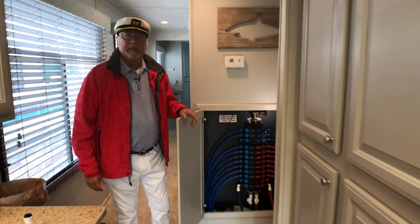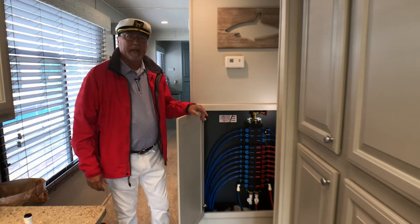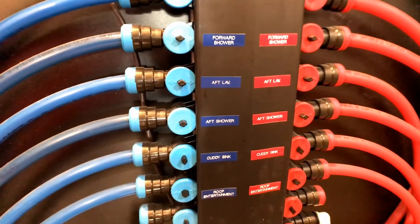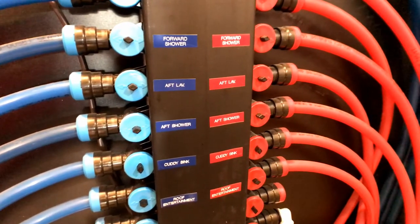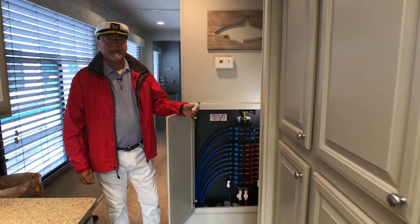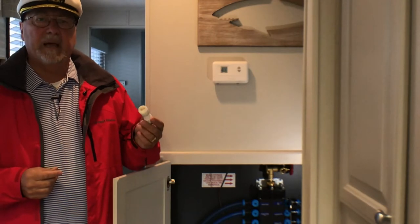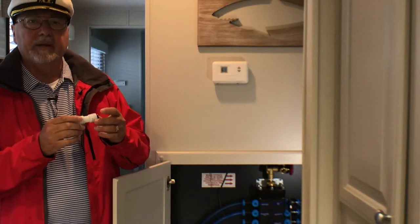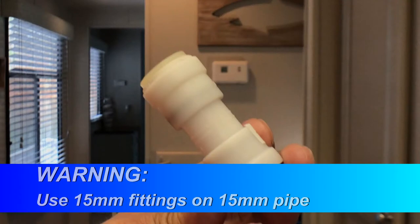While we're at the manifold, it's easy to see the type of water pipes used in the supply plumbing. This type of pipe is called PEX, which is an acronym for cross-linked polyethylene. The boat manufacturer has distinguished between hot and cold water using red for hot and blue for cold. A word of warning to owners who attempt to replace PEX fittings: check that you have the right fitting first. Marine manufacturers may use metric 15 millimeter pipe throughout the boat and not the half inch type found at a hardware store. Half inch connectors put on a 15 millimeter pipe will leak.